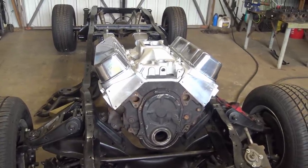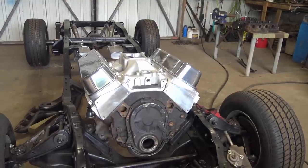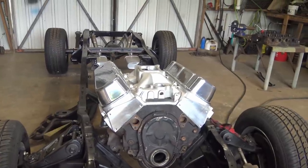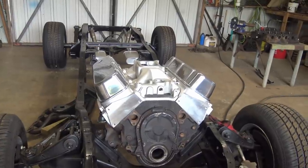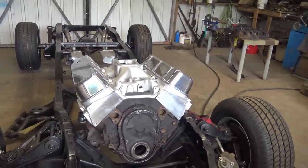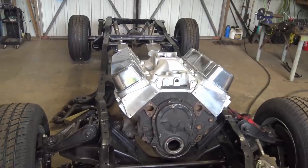I'm gonna go with like a 20 cc, 22 cc dome piston, so it'll have like 9 to 9.5 to 1 compression ratio. That Thumper cam has a 107 lobe separation, and you guys in the know know what that means. It bleeds off some of the compression between the intake and the valve opening and closing, so those cams require a higher compression because of that. So yeah, I'm thinking that'd be a pretty good combination. 9 to 9.5 to 1 compression ratio and a small Thumper cam, peanut port heads, and that intake right there. So that's what we're looking at.